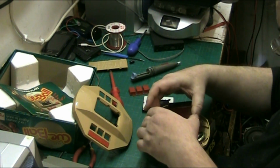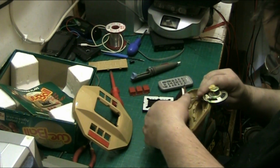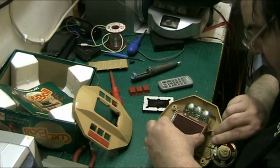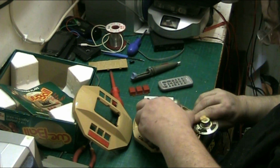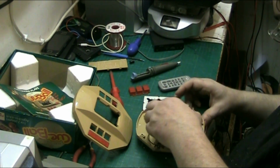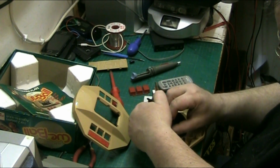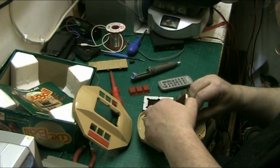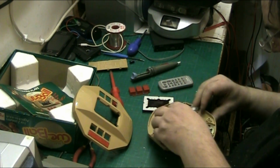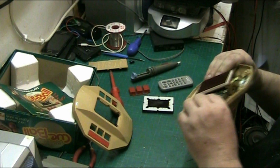Well, let's have a look. None of the capacitors I've put in a touch it, that goes through the middle there. Yeah, that capacitor there's catching. Let's move it over. There we go. And that one's catching there, so move it over that side and bend it slightly that way. See, that's the issue we have, folks. When they no longer make the right components.